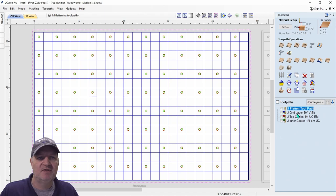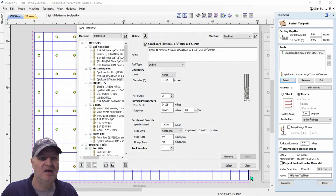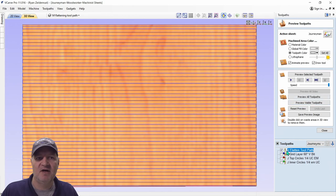You want to save and leave those toolpaths as they are. Looking at the flattening toolpath — this one is important. Right here you can change your bit. You can put whatever flattening bit you want in here, but for this to work properly it's going to have to be at least an inch, otherwise we'll have to change some parameters. The one I use is an inch and one eighth — I'll link all the bits I used in the description below. If you change this bit, do not change any of the other parameters, and be sure to hit calculate so that it recalculates everything.